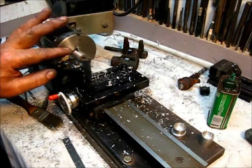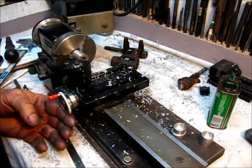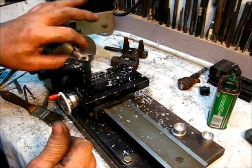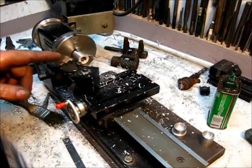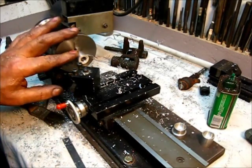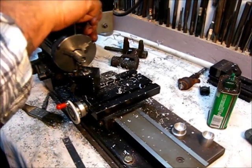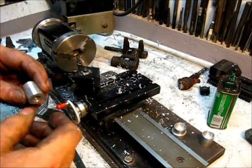I do have safety glasses on if that question is being asked. If you noticed what I did on the last cut — I put pressure on the bottom of this end of the cross slide, just ever such a little bit, because I wanted to only take off, let's say a cat's whisker, just ever so little. And I know if I'm past the larger size and I try to get any more and it actually goes a little bit, then this will be undersized.